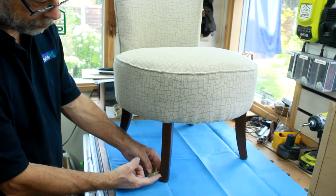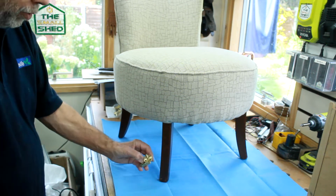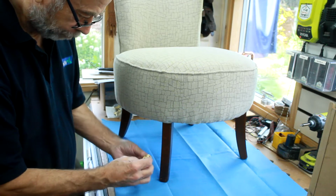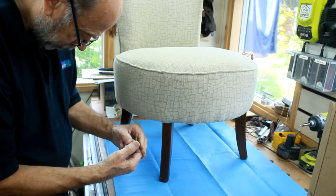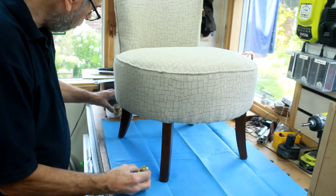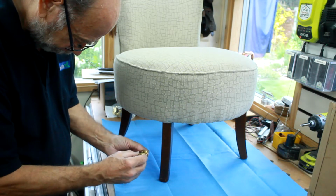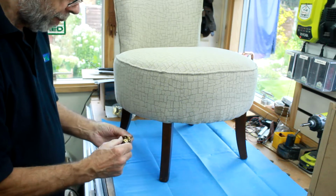So there's going to be about 30-40 mil off the end of the legs, and I think there should be just about enough meat when we get to that point for these fixings to be able to fit. They're quite nice brass fixings. They are screw in, but what is a problem is the fact that there's nothing to actually screw them in by. There's no screw head in order to get that screw fixing. So what I might have to do is make some sort of a double pinned thing to tighten them in. We'll worry about that when we get to it.